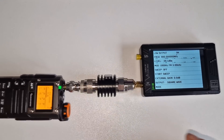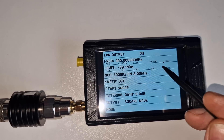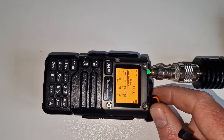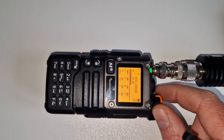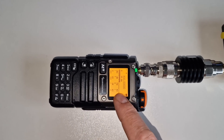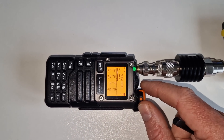Now I've got the Quansheng back on and lowered the frequency to 900 MHz — same signal level, minus 39.1 dBm through the attenuator — and you can already see the sensitivity is way better at 900 MHz. From testing done off camera, it basically gets more sensitive as you head towards the designed frequencies: the 70cms band and the 2-metre band. So if you wanted to listen to some 934 MHz CB on it, it'd probably work. Ultimately this radio is just a well-designed preamp away from being pretty useful on the higher frequencies.